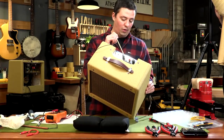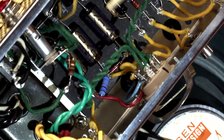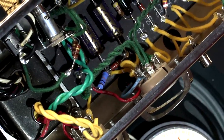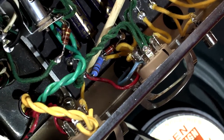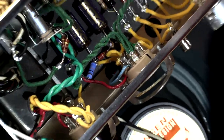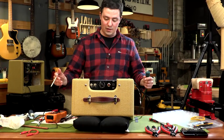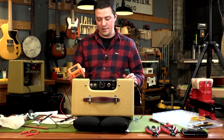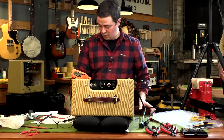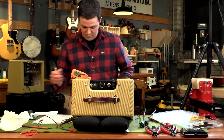I've got my meter set to 600 DC. I go ahead and plug it in. I can see my light bulb is on and I can just barely see the filament in my rectifier tube is lit. I check that first point and see 510 volts — that is what I expect to see. I go ahead and unplug this. The longer you leave that on, the more stress it causes to the filter caps. Nothing wrong with that 510 volts.